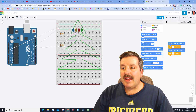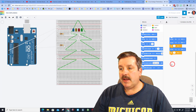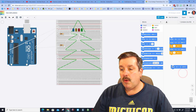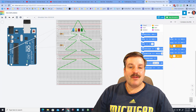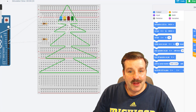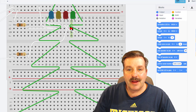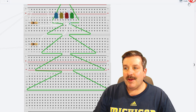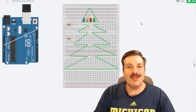This new set of LEDs isn't coded yet, so go to the code. Add 'set pin 10 to HIGH,' then set it to LOW, and drop it in with the delays. When we hit Start, we should now have additional lights. If you look closely and the lights don't work, check for a missing wire — connect it, zoom out, and confirm. When we hit play, we've got four lights just like we're supposed to!